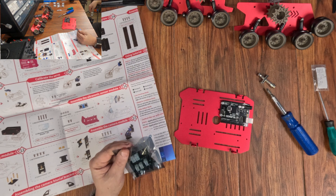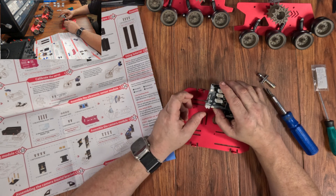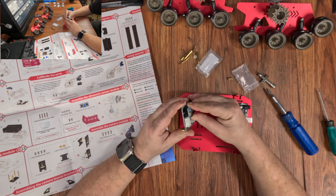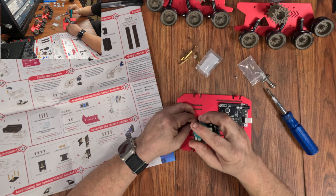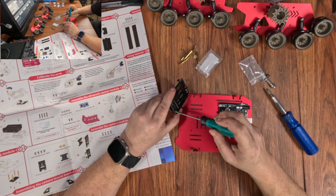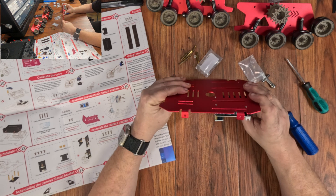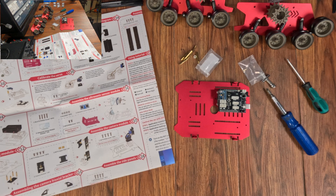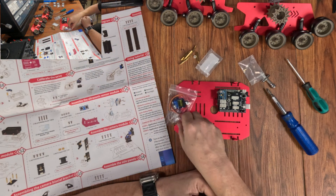After that comes the accelerometer board. This pushes into the expansion board with eight pins — male on this board, female on the expansion board — then two screws and a standoff secure it, and it's pretty rigid. This board's purpose is to let the Arduino know if the tank is actually moving and which way it's moving. The expansion board is where we hook up all our cables, batteries, motors, and stuff. It pushes into the Arduino with a lot of pins and the connection is really tight, so no standoffs or screws are needed.